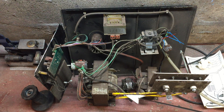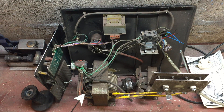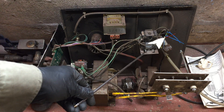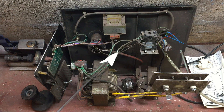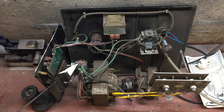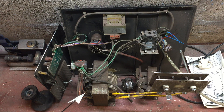It just bolts to the bottom of the machine on four bolts. Two wires come out — that's one of its windings. On the other side you can see quite a few wires coming in, because it's a multi-tap transformer, and that's to do with this selector switch here. When you pull the trigger, electricity flows up through the mains wires at 240 volts. It goes into this six-position switch which sticks out the front of the machine, and that selects which wires are connected. So this is your main transformer that turns 240 volts into around 24, 30, or 40 volts — going from 13 amps in to 180 amps out.